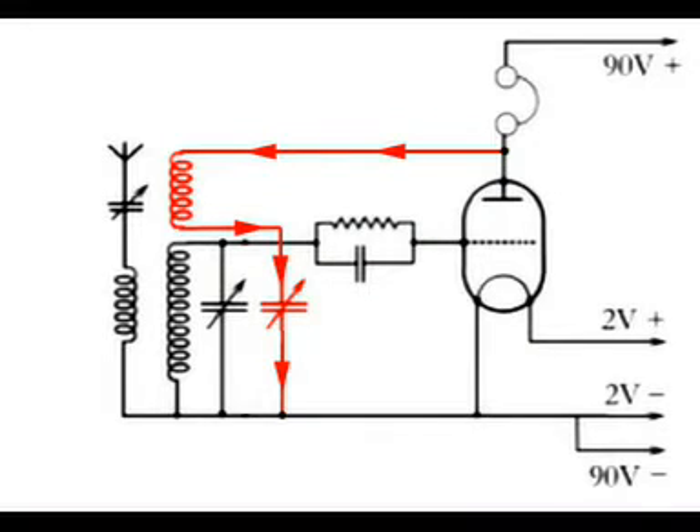Here's the revised circuit. A wire runs from the anode of the valve through a coil positioned close to the coil in the tuned circuit, then connects to earth via another variable capacitor — we've now got three. That's shown in red. If you increase the capacitance, more current flows through the red coil and it couples into the large coil of the tuned circuit. In retrospect, an extremely simple idea.